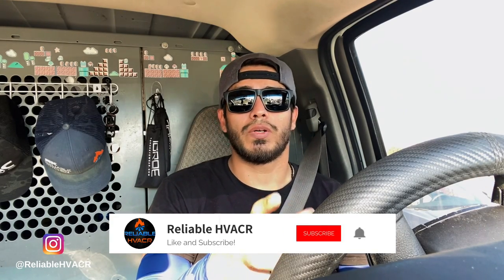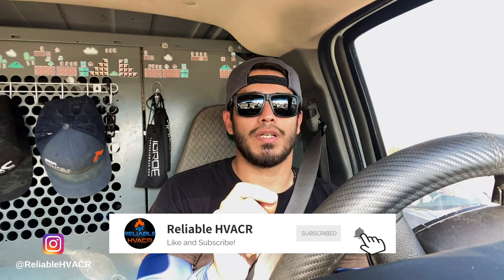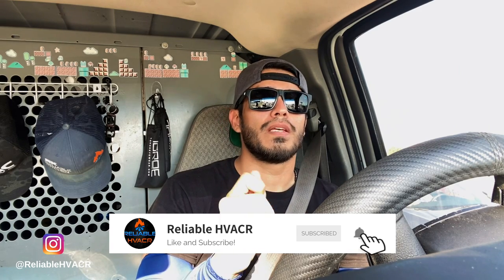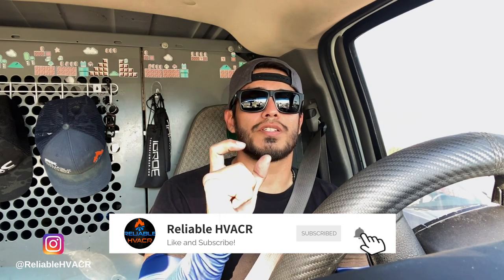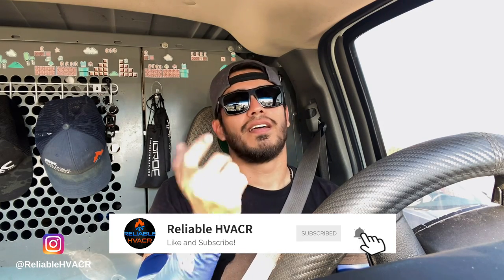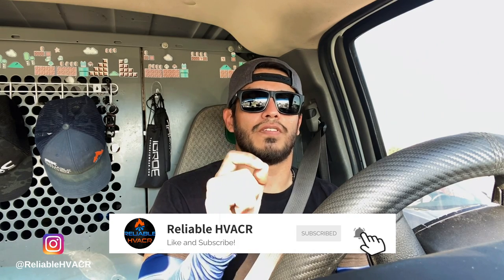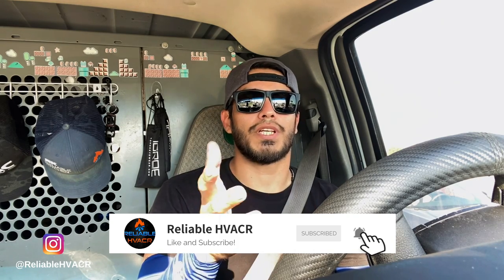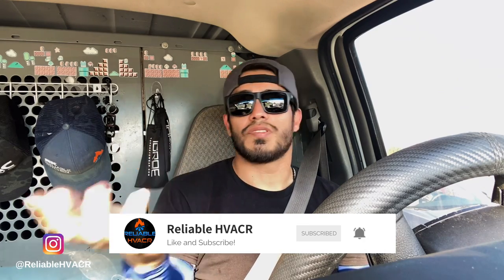All right, so I've got to go back to that Intelligen. That customer, the supplier that sold them the equipment, sent out the parts. I needed the electronic expansion valve. It's stuck closed. I know they usually give you the coil and the body valve, so we'll see. I'm going to see if the coil is the issue or if it's the actual valve, and we'll change out whatever we need. And we'll see how it goes.